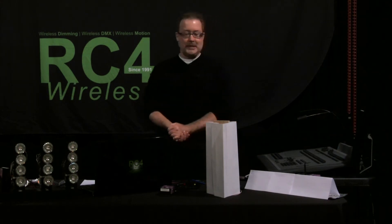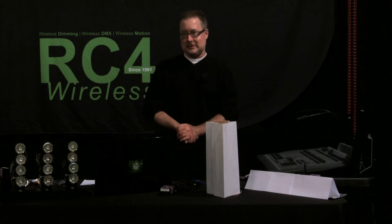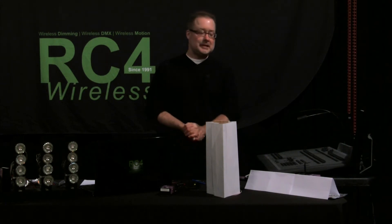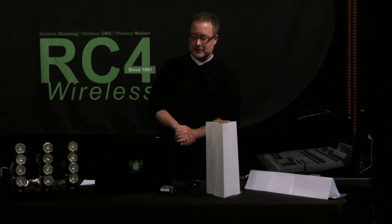So let's see if we can make the two look the same. We want to do that because maybe we've used red, green, and blue LEDs in a prop — we bought the parts from a component supplier, it was the necessary way to make the effect. And now we want to use HSL color modeling and ensure that it's going to look the same as other LED devices in the same scene. So let's do that matching now.